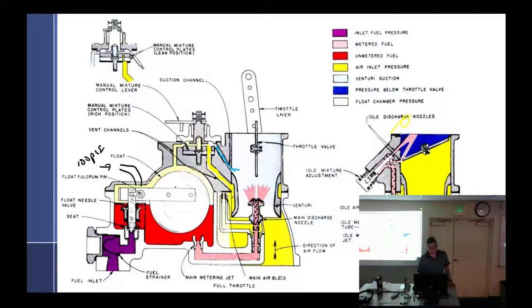If I did put a lot of pressure in there — other than the fact that it's going to smash the floats — it's going to push fuel out really, really fast. So that's a huge pressure differential. So: don't do that. What if I pull a vacuum on this? Yeah, you've got those little handheld vacuum things or a shop vac. What's that going to do to output while it's running? Less fuel. If the vacuum matches here, then I'm getting nothing. If I vented it to right here, would I get any fuel flow? No.